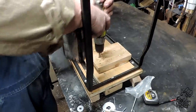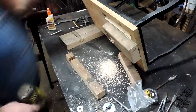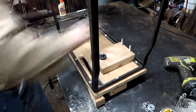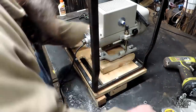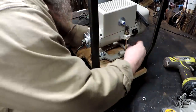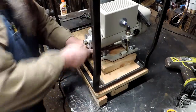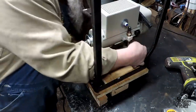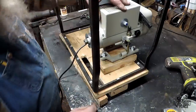Besides the argon and the wire and a little bit of glue, the rest of this material is just salvaged materials. At this point I literally have $220 into this thing, and I think that's about all I'll have into it other than maybe some thread — those run about $3 a spool depending on what you're looking for. I've got some number 90 thread and some number 20 needles. The needle's a little bit big for the thread size but it should work okay. This machine will take industrial needles or regular non-industrial machine needles.